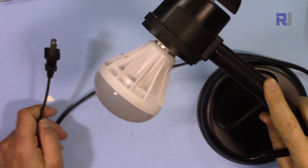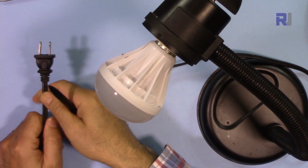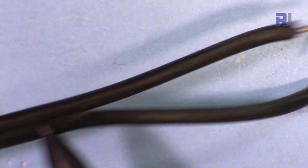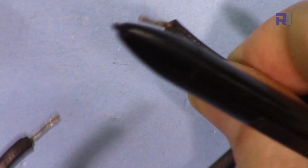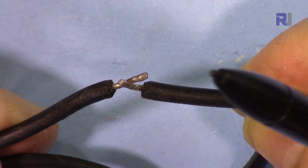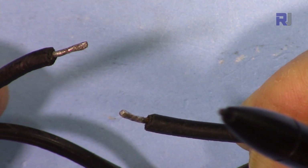This is an AC desktop bulb, and this is a power plug that I connected to the wall, and 120 volts will turn on and off. Now at this point, I've cut one of these 2 wires and twisted it and soldered it, so it can be connected to the relay. The job of the relay is to connect this, and the AC bulb is on, or the AC load, whatever fan you have, and disconnect it to turn it off.